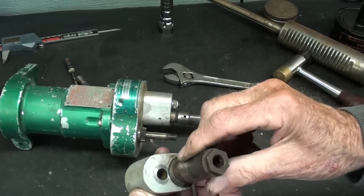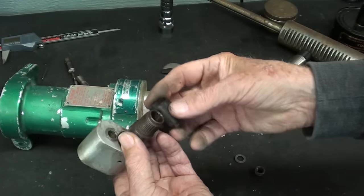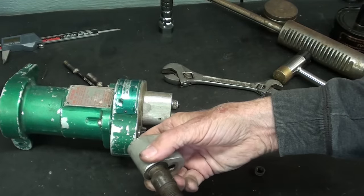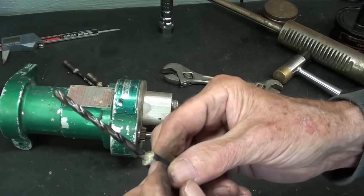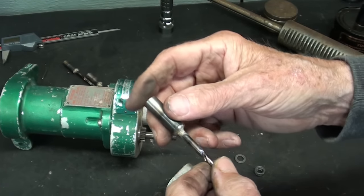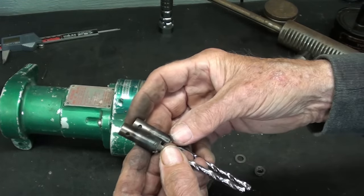Even when I bought this I thought, how the heck am I going to hold a drill in here, because it's obvious that there are no collets or adapters — none were included. What I did was take a piece of stock and turn it down to whatever fit in there. I silver soldered the drill bits in, but the first attempt wobbled badly because I hadn't reamed the hole — I just drilled 3/16ths. I had to make two more and ream the holes, which worked much better.